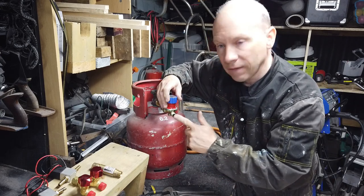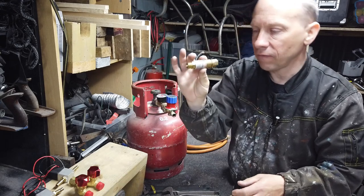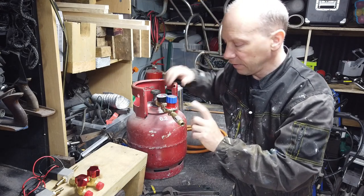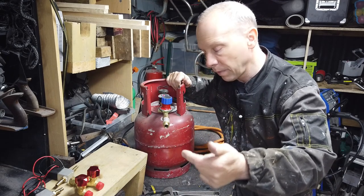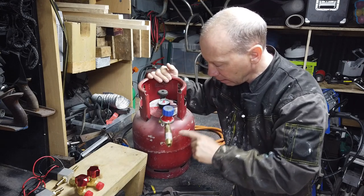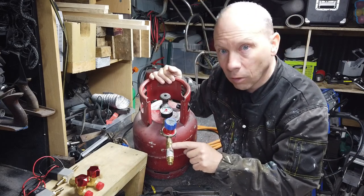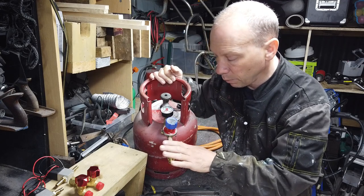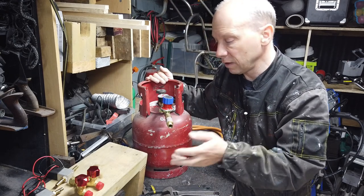Now we can't just set fire to the gas coming out of here — again, that wouldn't work. What we need is this very, very important little gadget — it's called a flashback arrester. That is simply going to clip or screw onto the back of the regulator. It serves a very, very important purpose. Coming off here there's going to be a tube, and ultimately we're going to ignite the gas that comes out at the end of this tube. If for any reason the flame was to come back down this tube and back through the regulator and into the cylinder, it could ignite the vapour inside the cylinder. That would be very, very bad. So we fit a device that stops that happening — it stops any flame or ignitable source coming back down through the line. It's called a flashback arrester. You want to fit that as close to the regulator as possible. Not everybody uses them. We use them. They don't cost a lot of money and really, it's a no-brainer. Put one in.